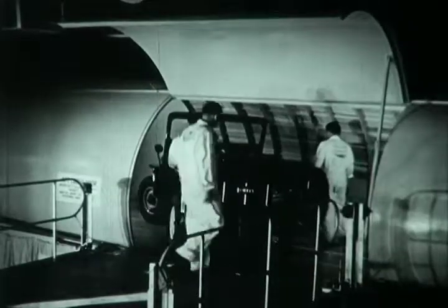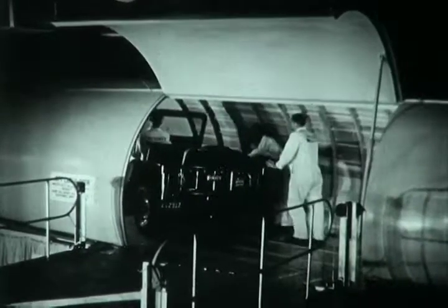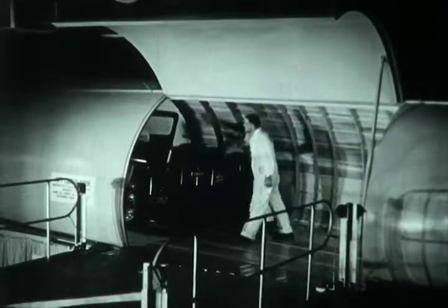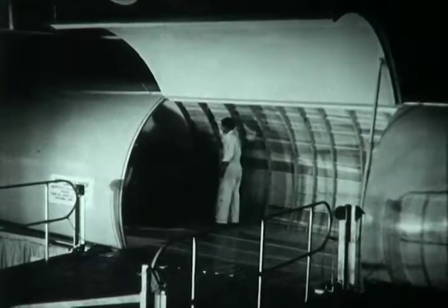Floor tie-down fittings are provided in an 18.4-inch grid. Working loads of 2,400 pounds are permissible on fittings in the main cabin floor. The wall fittings have working capacities of 800 to 3,000 pounds.